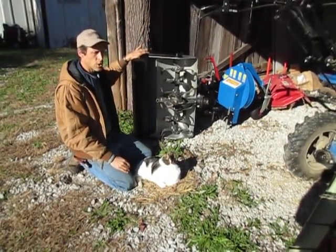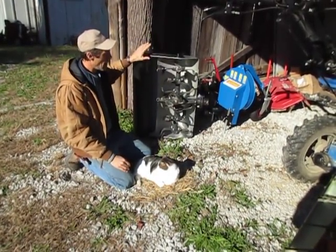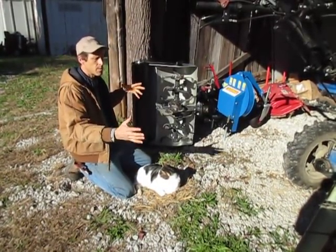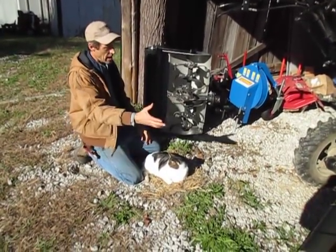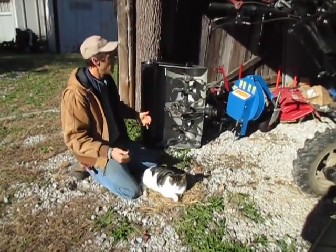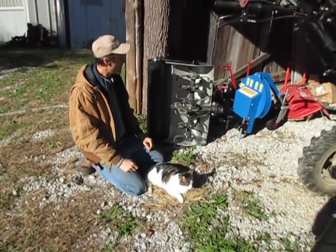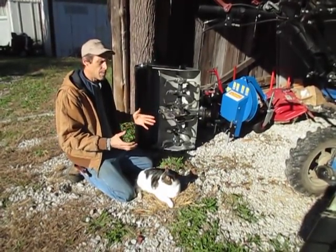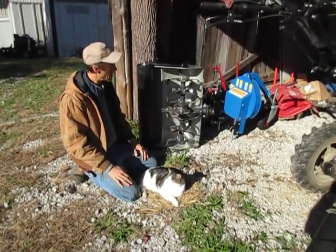The Earth Tools depth roller system is considerably less money — we sell this for $500 to $600, plus the tiller for $800, so you're getting close to half the cost of a Power Harrow. So there you're actually talking a pretty good difference. And if you're a farm on a budget and just can't afford the extra $800 for the Power Harrow, then the tiller still can work. You just be careful with it — don't over-till, run your engine slower. And if you're using a broad fork to break up any potential hard pan, broad forking once a year will erase that, so you can mitigate that.